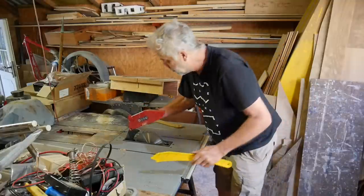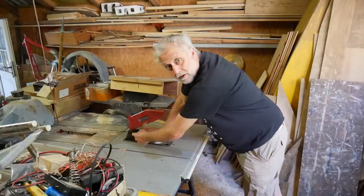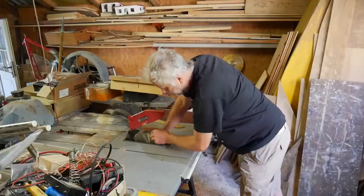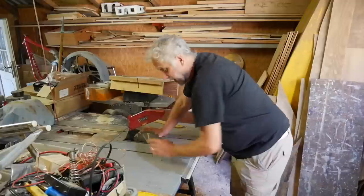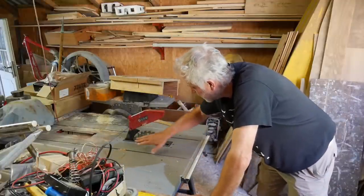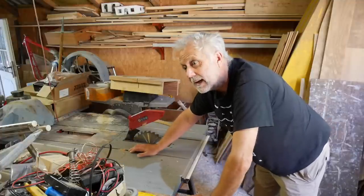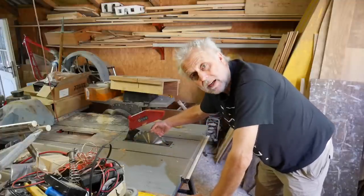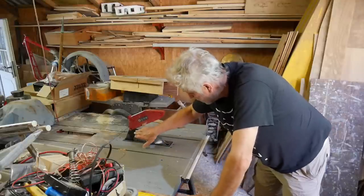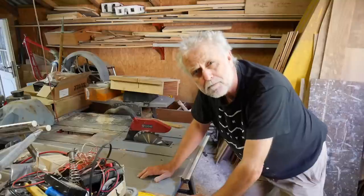But other than that, not a problem, comes off easily. The riving knife is very, very important. Set it accurately so it's just clear of the blade. This one, on the latest saw, stuck up above the height of the blade, and I didn't like that because you couldn't cut anything more than 9 centimetres deep on it. So I cut it off shorter and drilled a new hole to fit the dust catcher there.